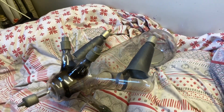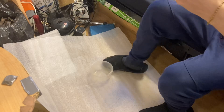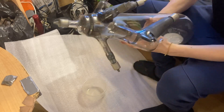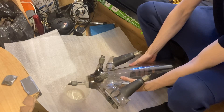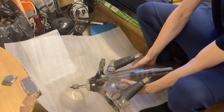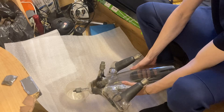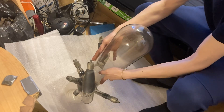The bracket's up. Now we've got to flip that over and get the mercury in the bottom without the bottom falling off, so we've got to take it very slowly. I've got the tub on the floor — if the bottom does come out, with any luck the mercury will go in there and be contained. Because the mercury is quite heavy and it can actually knock the bottom out if you're not careful. So very, very slowly over this. There we go.